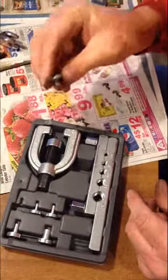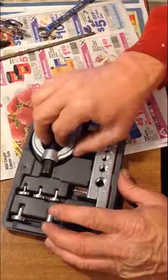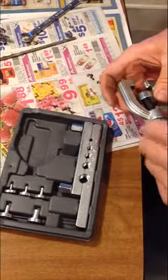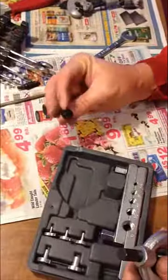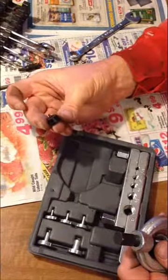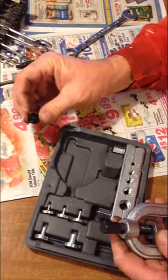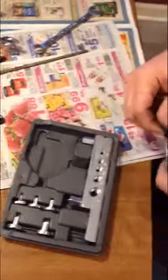So it's just a low quality tool, but you can make it work. I want to show you how to make this thing work and let you know that there is a workaround. I found that Eastwood sells the same basic part — a little bit different configuration but it works just fine in here. I've flared a number of tubes with this and it works really, really well.